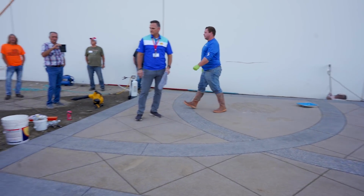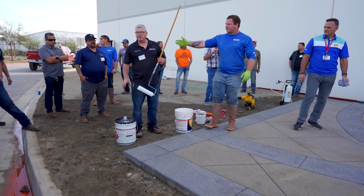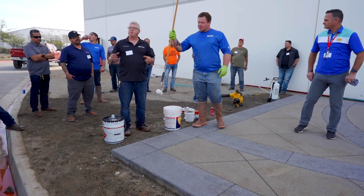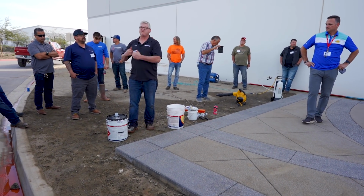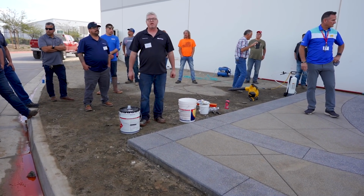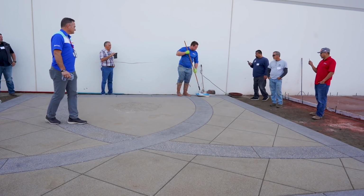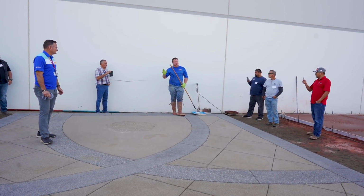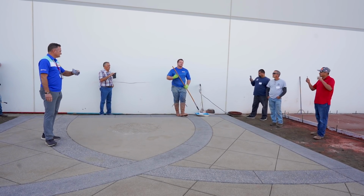Another thing too, when you're rolling, these pans are kind of tough to work with. It's good to get a 5-gallon bucket and one of those paint strainers that hooks to the side. It's a lot easier and it'll save you a lot of time if you're a roller. The other thing I found on the sand finish is that it's always best to roll your first coat and then spray your second, so you know you're getting it all down in the pores on the first coat.